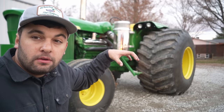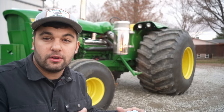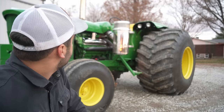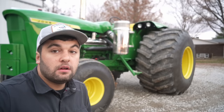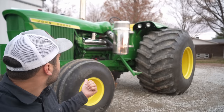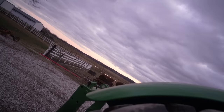So we got this tractor and it had a cab on it. To cover the turbo where they mounted it, they made a really big clumsy-looking shield that went around the turbo and bolted to the cab. Since we took the cab off, we couldn't reuse that, so we went ahead and took a small LP tank and formed it to the hood, and it turned out pretty good. There's a lot of clearance up in there under that tank. The exhaust pipe is welded — the 90-degree elbow that comes up out of the hood was rusted out when we got this tractor, so I put a new one on, welded that top pipe together, smoothed it out with the grinder, and got it chrome. So it's a nice one-piece straight pipe with no clamps except where it connects under the hood.